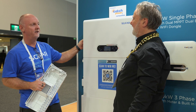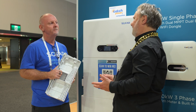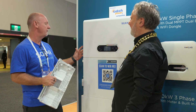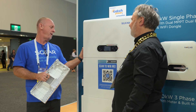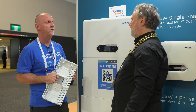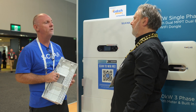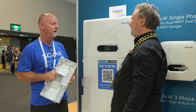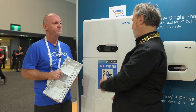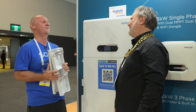We also have the battery DC isolator on this side — so again, no external isolators required. It really lives up to its name, Power All. It is an all-in-one solution. It's tidy, it's neat. It's only about 180 mil deep — very unobtrusive. Sit it in your garage, sit it against the wall outside. If you're mounting it outside, we want to have a rain cover or a shade sail over it just to keep the sun off it. This is the kind of product that homeowners are expecting to have in their house. I'm loving mine — it runs my house. I've got it on the south side, so I don't even have to have a shade over the top.